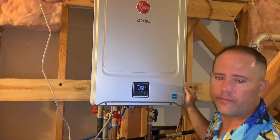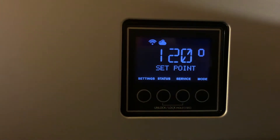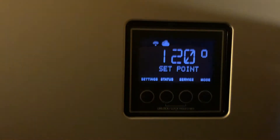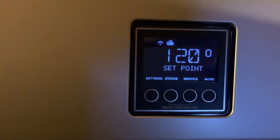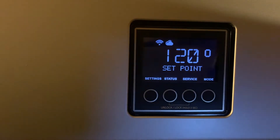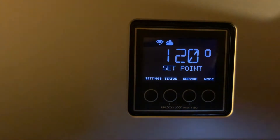This particular water heater is in service, it is working, there are no known problems with this heater. It is also important to note that if you are encountering errors with your water heater, check the gas supply, check the gas pressures, and also check the venting. Improper gas supply pressures and/or venting will cause issues with your water heater.